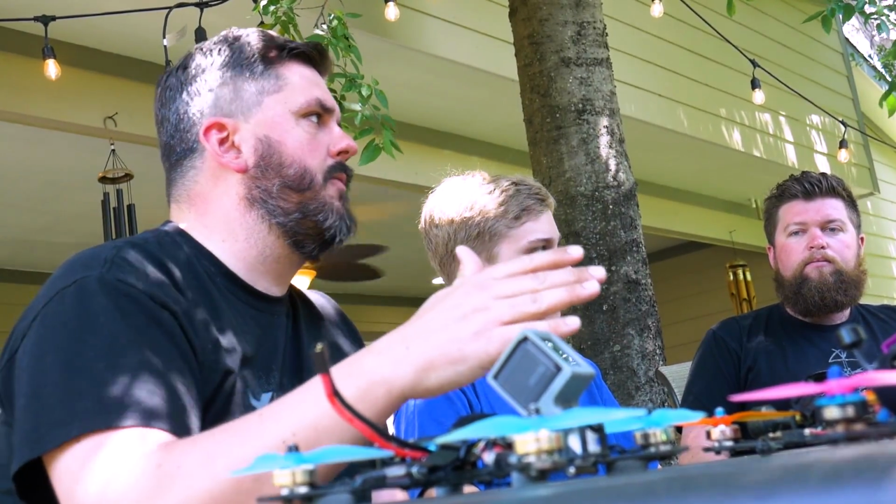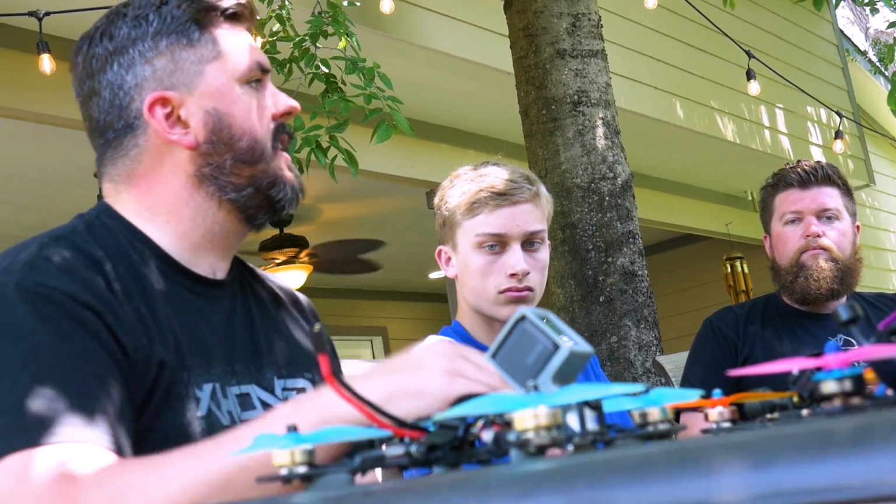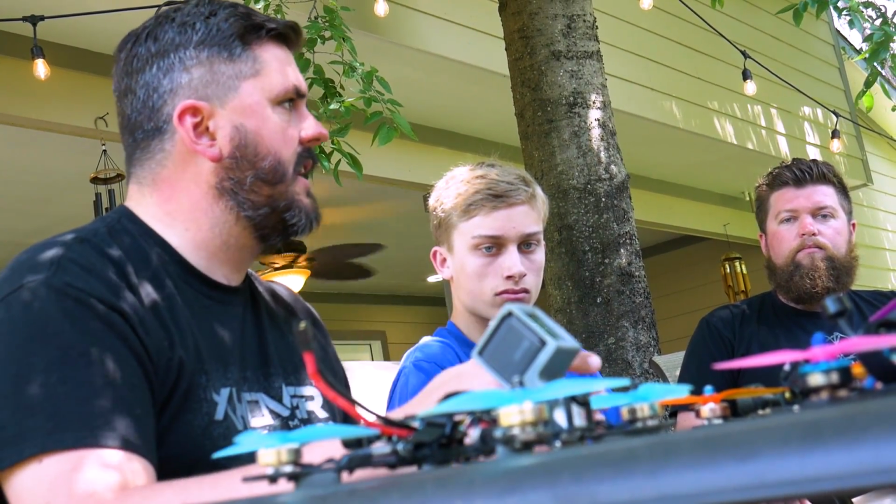If I'm outdoors in a big space looking to hit higher speeds and a lot of punch outs, then I like the more aggressive prop. If it's more of a proximity thing and it's not about getting up to speed fast, but about having a nice flow or hitting precise gaps, I prefer the better throttle resolution you get from a lower pitched prop.